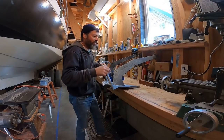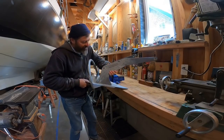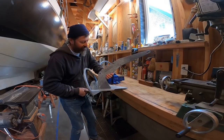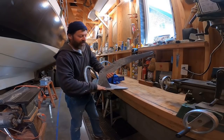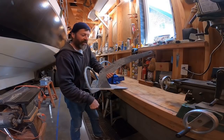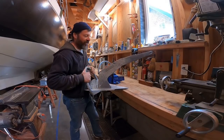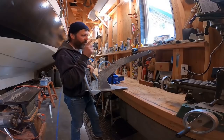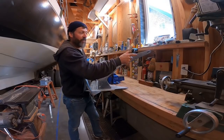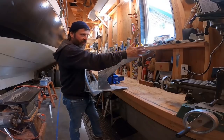So in short, as it goes deeper and deeper, the anchor is probably going to end up flatter and flatter. At some point, when the fluke is horizontal or nearly so, it's not going to go any deeper. If the seabed lacks the heaviness or the consistency to stop the motion, then the anchor will just continue to drag forever. It may not come up, may not go down. Again, it might just stable drag.